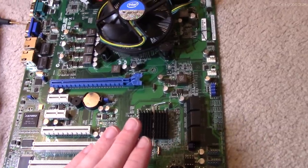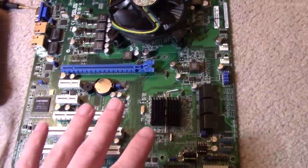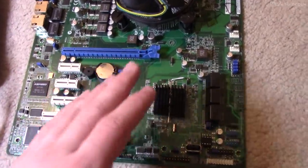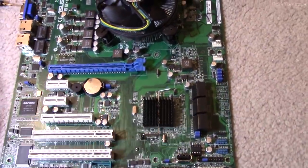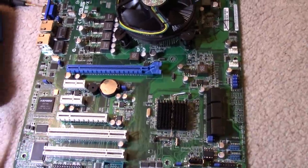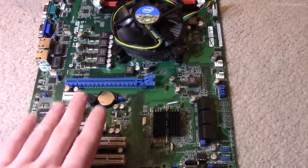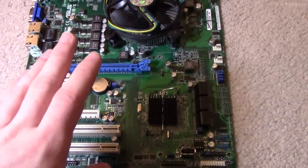That's kind of a good sign and kind of a bad sign. Good sign means we don't have anything obviously blown. But it's also a bit sad because power supply stuff is pretty easy to fix — these regulators and transistors are really easy to acquire and replace. So we're going to have to dig a little bit deeper. Obviously we need power to make everything work, and we also need a clock — we need crystal oscillators to get these chips running.